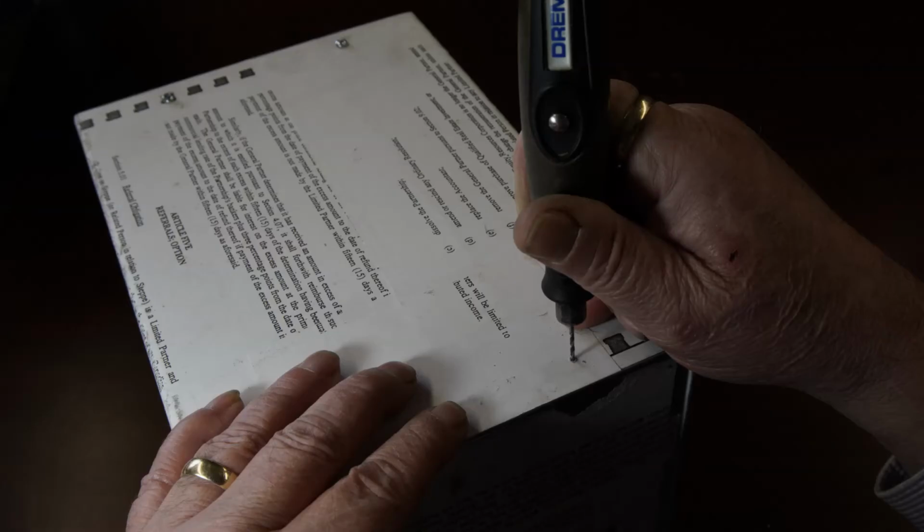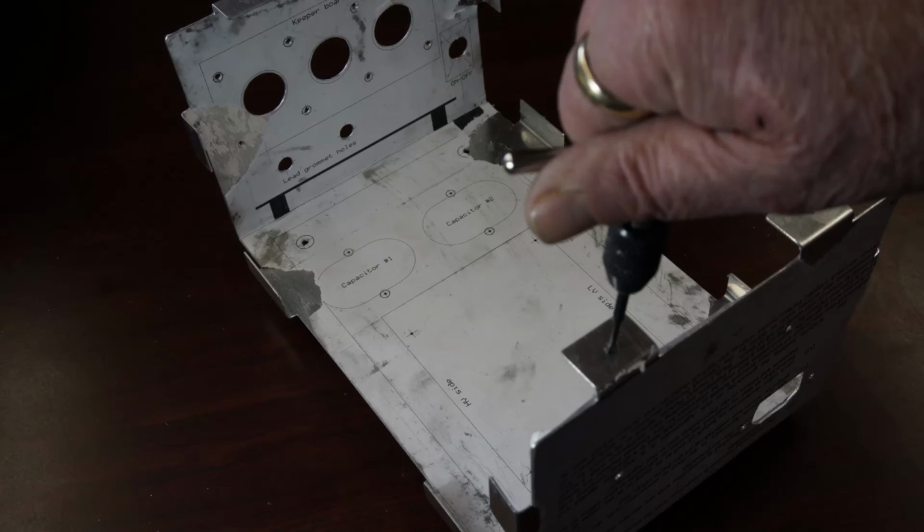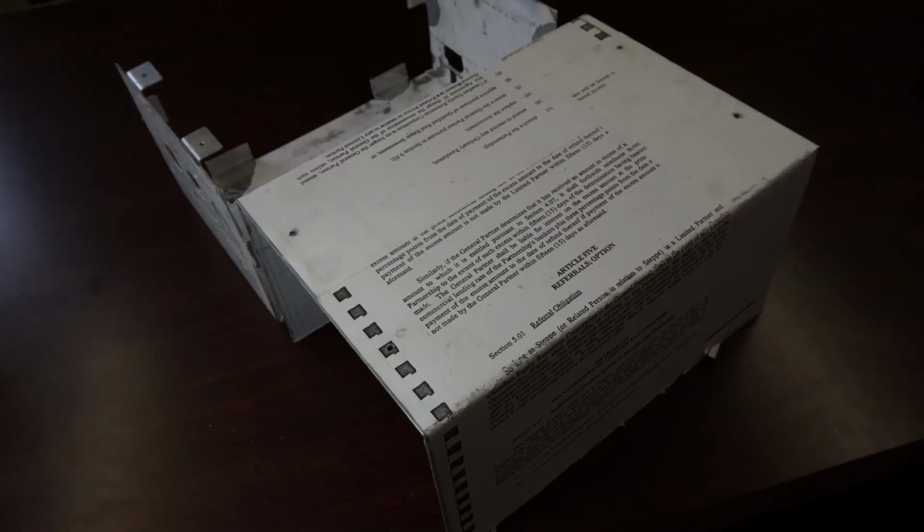Hold the 2 pieces in the right relative position and drill the pilot holes through the tabs. Enlarge the holes and tap the inner ones. Note that it will be necessary to remove the screws along the top of the front face in order to do this. This is a good time to mark the inside of the cover. Note that the cover is symmetrical. The front end is nominally the same as the rear end.